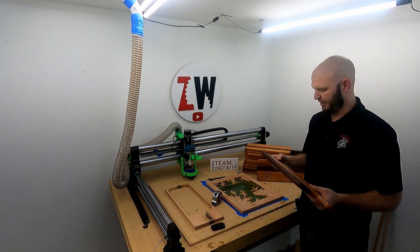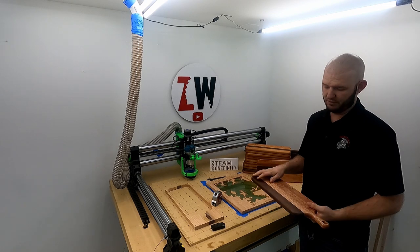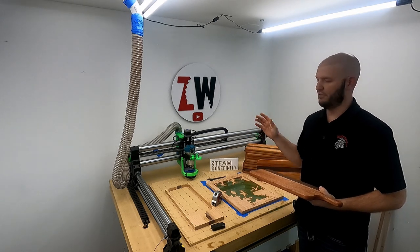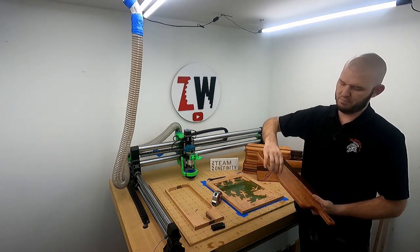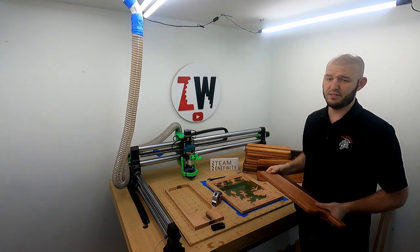But anyways, this is a good way to get Christmas presents out the door. It shouldn't take too terribly long. Really the thing that took the longest for me was getting these nice and flat and smooth. If you are going to plane with your CNC, I would advise to look up my tramming video. That'll really help you save a lot of sanding, or else you'll have big marks whenever you do this, depending on which way you go. That will take a lot of time to sand out.